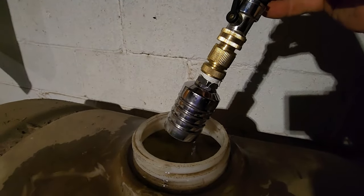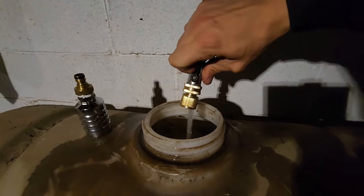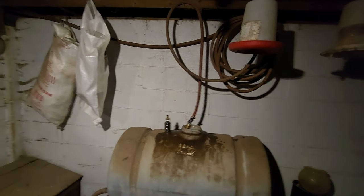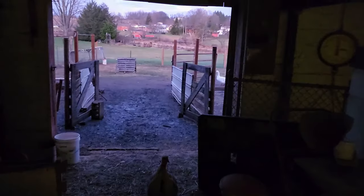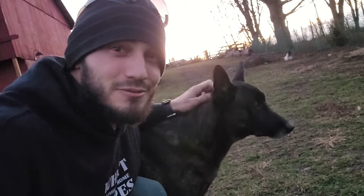I have it wide open and it's not really flowing very well and it's still leaking out of the connection. I don't think this float valve is going to work — I'm going to have to go get an adapter for that other float valve from Tractor Supply. When I take off the float valve we do have a pretty steady water flow, so the float valve is the problem, not the hose. I couldn't bring myself to cut that hose just yet — I want a little flexibility with it to spray down the pigs or wash the walls. I'm running out of daylight and the ducks are starting to migrate over here, so I'm going to let this fill up as is. Not all the plans work out, and I'm just bringing you along for the whole process here on the homestead. If you enjoy these homesteading videos, make sure to subscribe, hit the like button, and I'll see you on the next one. Thanks for watching.